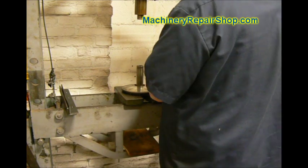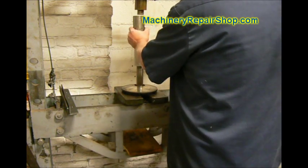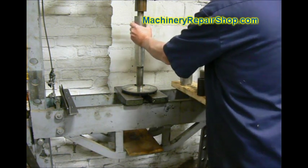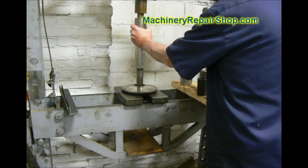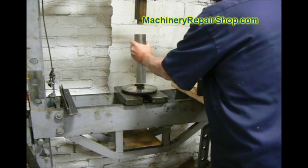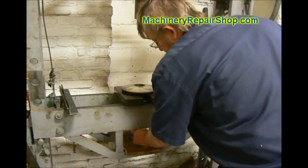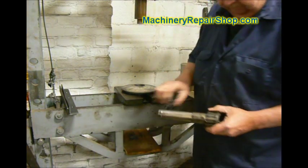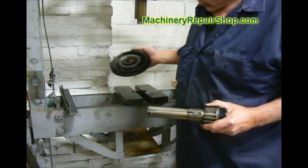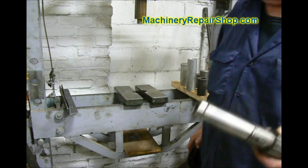We use this press for all kinds of stuff, so rather than adjusting it, we just stack stuff up on it. You can see here there's a key — don't lose that key. That key is what aligns it with the pulley. This shaft we're about done with; we'll clean it up. Next thing we want to do is get this bearing and its retainer plate out.